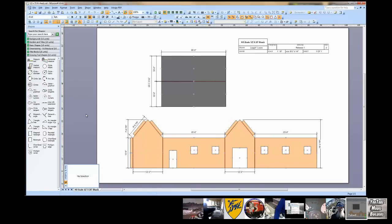One command module and 3 boosters. Yeah, 4 districts. The boosters just give you the power that you need to keep the train running when it gets further away from the command module and out of its power range. Well, the DCC signal from the command station is too weak to do anything. So you need the boosters, just like an amplifier on your stereo. On a true stereo, the signal is so weak you wouldn't hear much, so you put a big amplifier on there so that you can hear it. And it's the same thing with DCC.